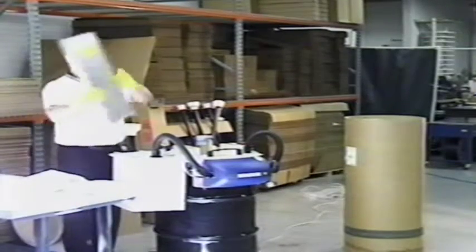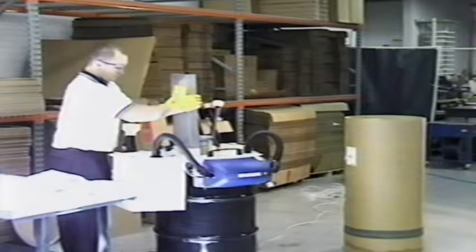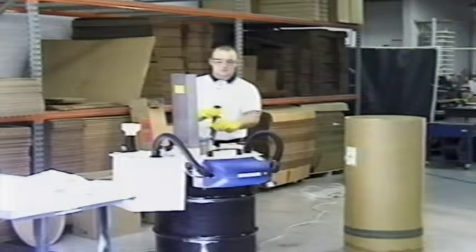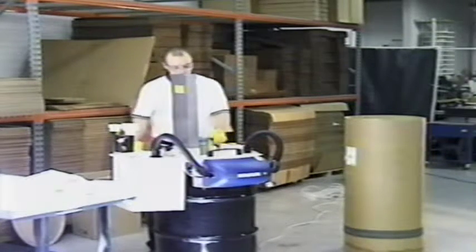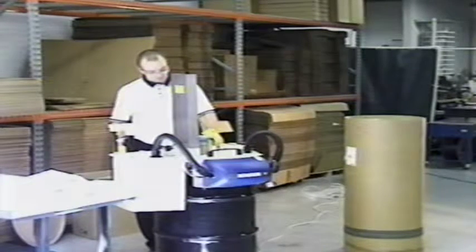For U-shaped fluorescent lamps, pull the safety cover up from the Bulb Eater lid and insert the stainless steel chute. Then remove the entry tube and screw in the cap to seal that entry point. Before crushing, pull off the bar between the two ends of the lamp and then push the lamp through the trapdoor of the chute and let go.